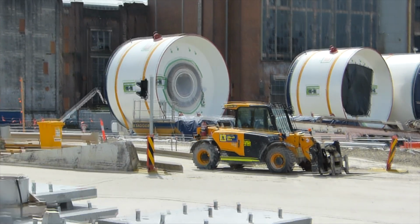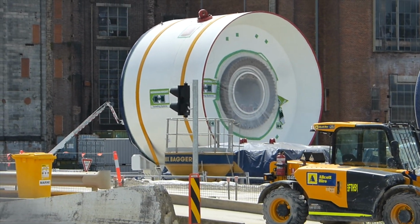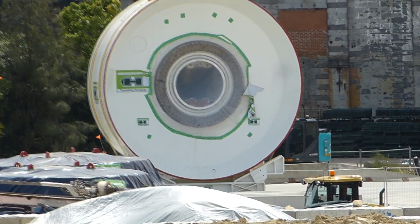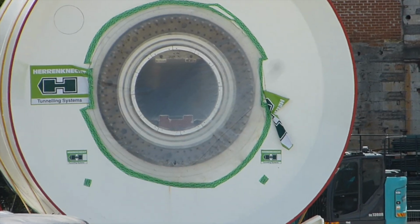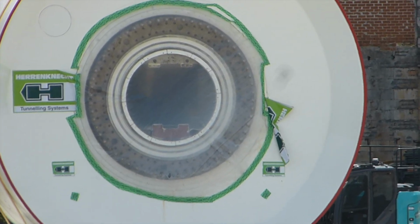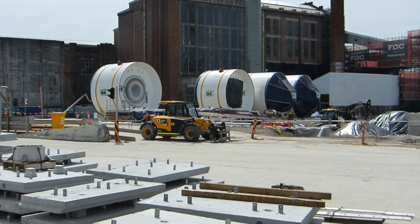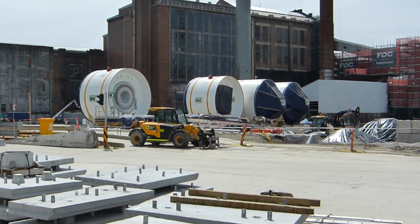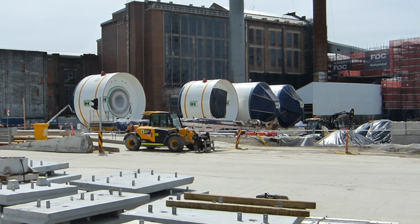Now I don't have the instruction manuals, so these are my observations based on what I can see. It looks like the Cutterhead, which I'll show you in a moment, will be attached to this front shield, and it seems that the circular bit in the middle contains an electric motor that will allow this and the Cutterhead to turn. And yes, TBMs are powered by electricity and will receive power via underground cables that come from a dedicated electricity supply from the nearby substation in Rozelle.